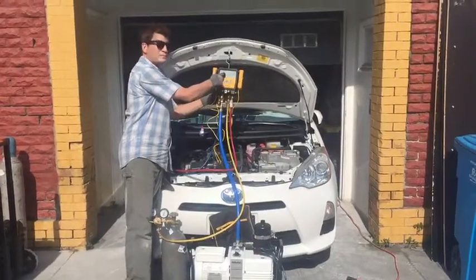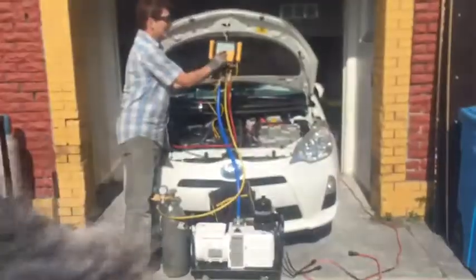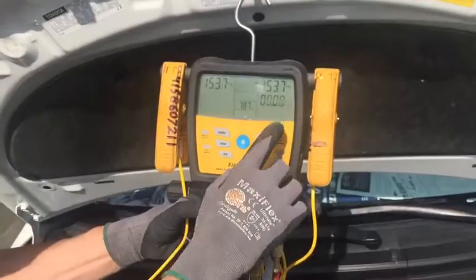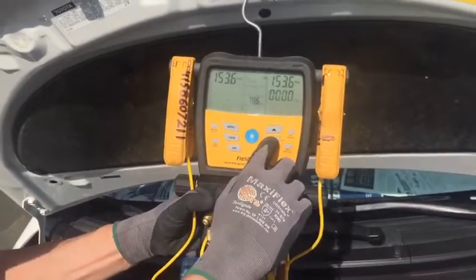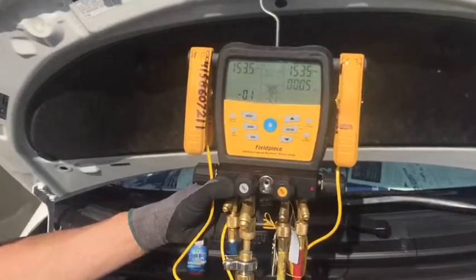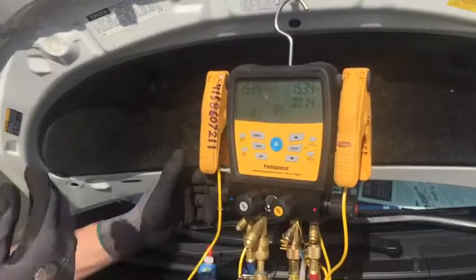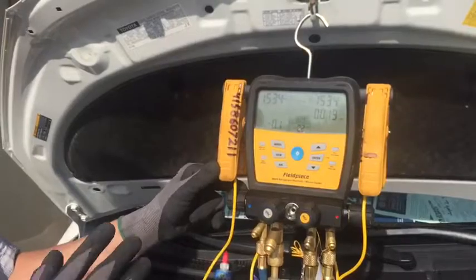As you zoom in here, you'll see the gauge has just gone into what's called an isolation test. When I press Enter, you'll see the timer start counting down. Now the timer is going — you can go off and do other work while this is isolated. We have 150 PSI in the system and the timer will count down. Leave it for 15 minutes to an hour to make sure you haven't lost any pressure.